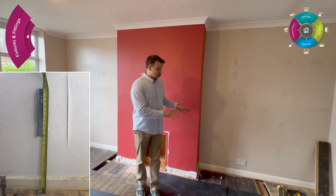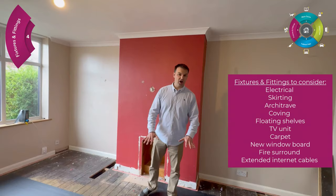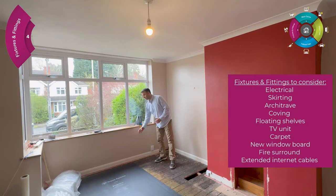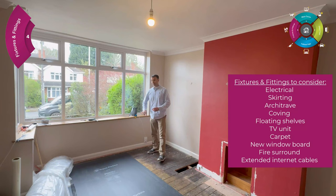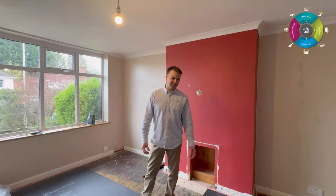When you're actually building your soundproof wall, take those fixtures and fittings into consideration, and then you can put whatever you want on your new soundproof wall. The finished floor will be carpet, and we're going to put a new windowsill on this window wall to account for the 25mm space loss from the 50mm system installed to this wall. Because the dot and dab plasterboard is potentially 25mm we're removing from this wall, and the wall system is 50mm thick, there'll be a 25mm net space loss on this window wall.